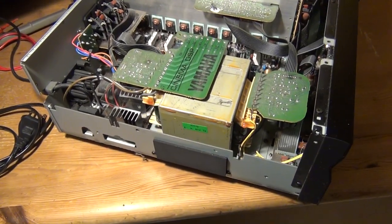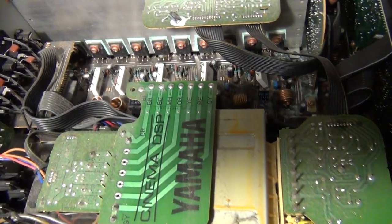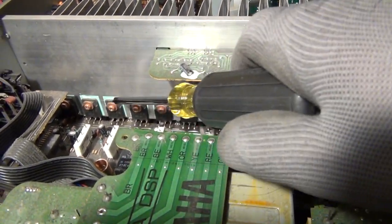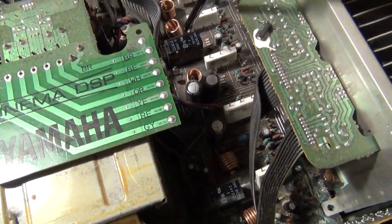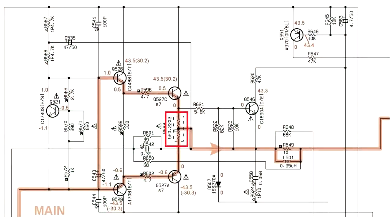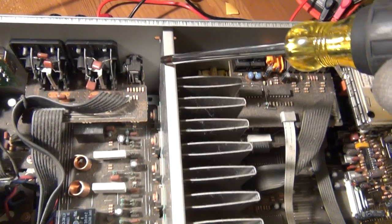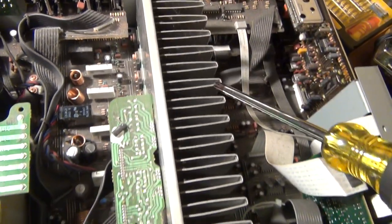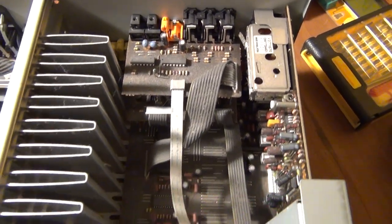There are a lot of similarities to classic stereo amplifiers. Here in the front we have the power supply unit with a large mains transformer in the middle, and here we have 10 power transistors making up 5 pairs of complementary bipolar transistors at the output stage of the power amplifier circuits. These white components are pairs of power resistors, and the contacts on top can be used to measure and adjust the idling currents of the power amplifiers. We also have a large heatsink of a construction style typical for Japanese audio equipment, video input selectors, the tuner, and the DSP module.